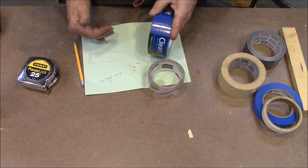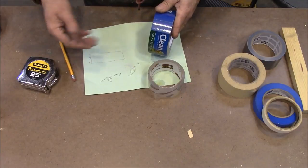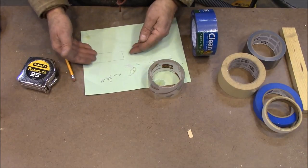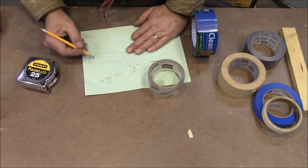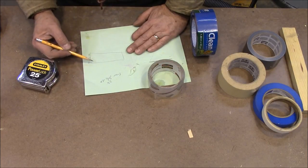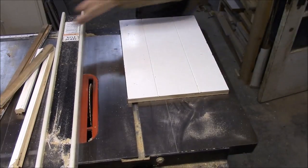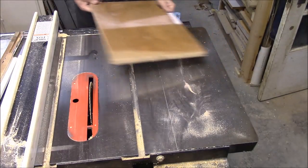The front and back can be the same height. If the walls sit all the way down to the tabletop and the bottom fits up inside, the side walls need to be three-quarters of an inch more — so the side walls are three and three-quarter inches, and the bottom is six inches by whatever length we've got. Let's set the fence to six inches and cut the bottom piece first.